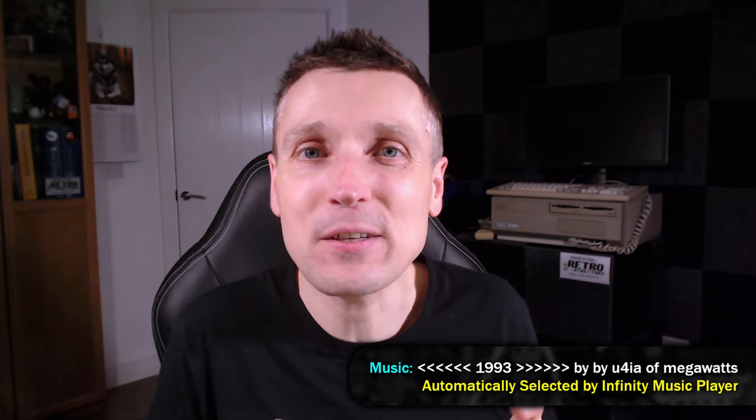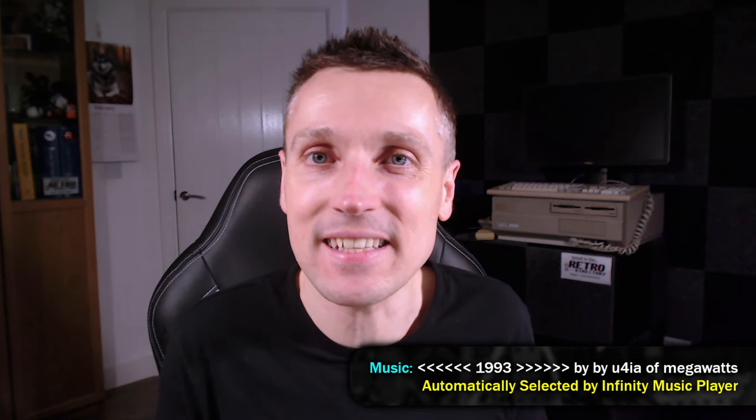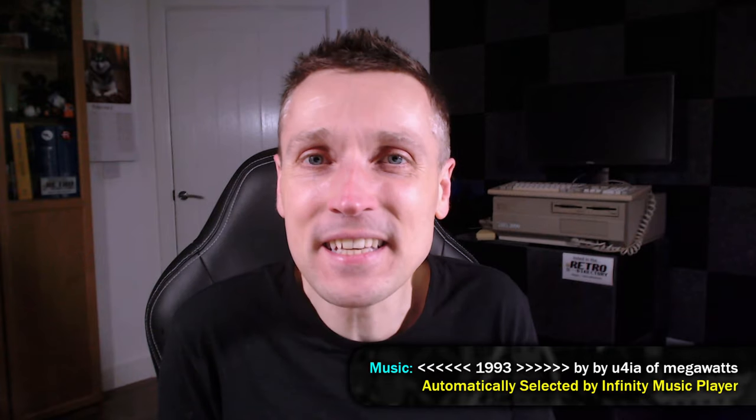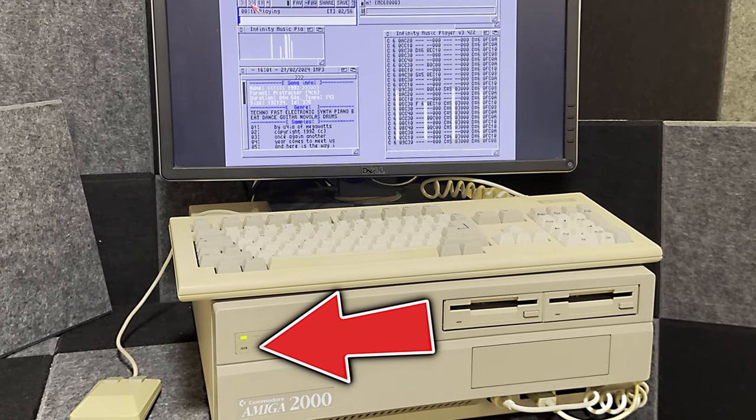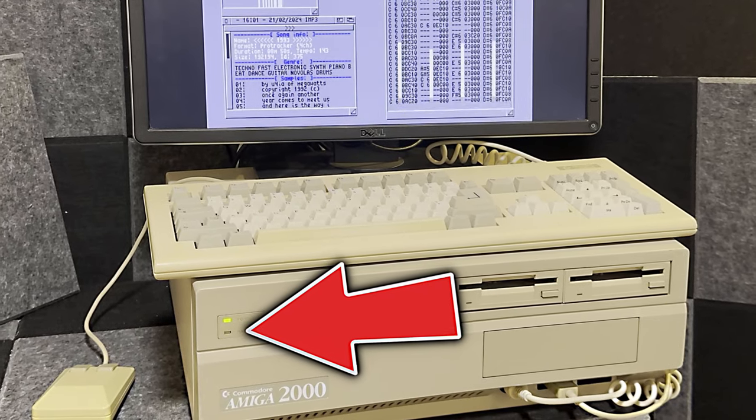What really surprised me was that the WiFi signal manages to get outside of the Amiga 2000 case — that thing is built like a tank and solid metal everywhere. Maybe it's escaping through the tiny sliver of plastic where I've mounted the BlueSCSI. The only downside is that while it's running, the hard disk light will flash constantly, though I'm sure there's probably a way to prevent this in the BlueSCSI firmware. So there you have it — that's what I was doing in the evenings and weekends for the last couple of weeks. I've put everything on GitHub, links are in the video description. If anyone wants to take up this project, I'd be more than happy. And Roadshow just got an update last week too — fantastic! Thanks for watching.